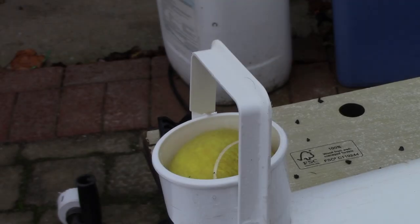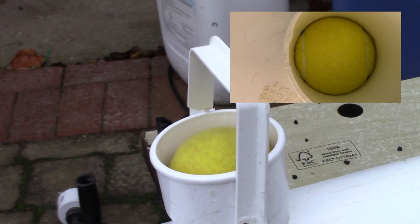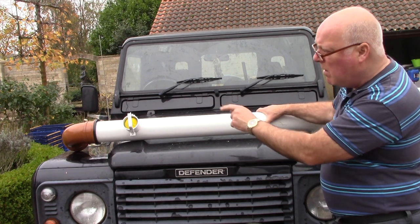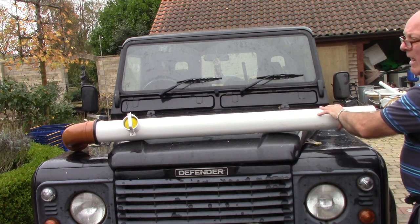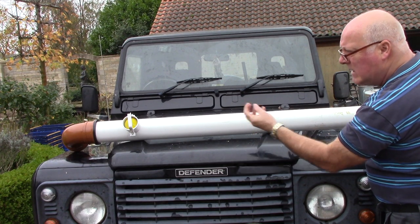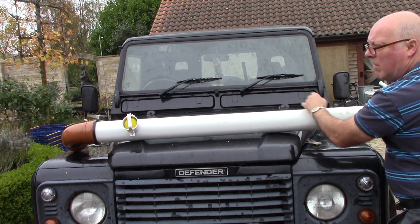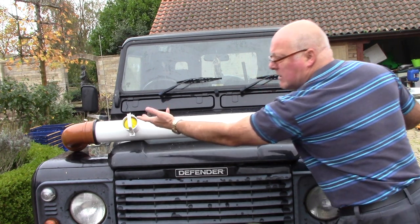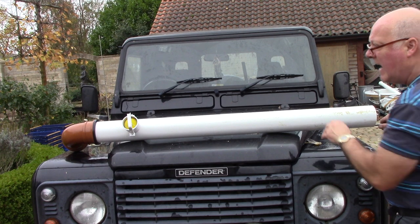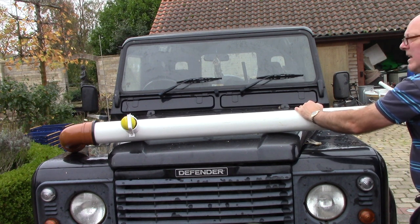Here's the completed filter. I'll explain how it works and what these tennis balls do. As you draw the air into this chamber, the ball at the end will allow air to enter while the other one remains closed, blocking the chamber. When you push it, the other ball stops the air from being pushed back out into the atmosphere. So they work together — air coming in, air going out — that's how they work.